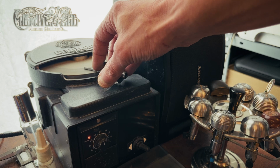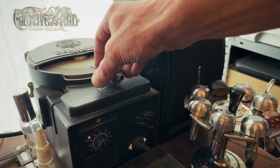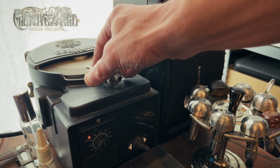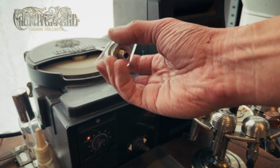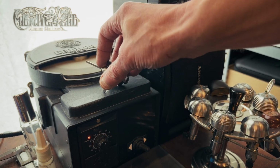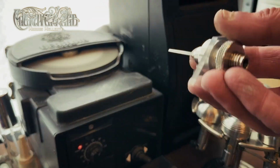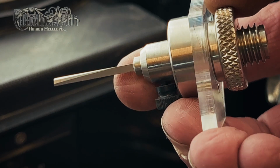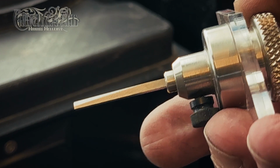First, the two belly sides. If you don't have a power hone, you just have to use the bench stones. Or watch till the end and I'll show you a cheap alternative. I'll speed up the process a little, if not the video will be very long and even more boring. It may be difficult to see on the video, but now the belly is evenly sharpened on both sides of the graver.